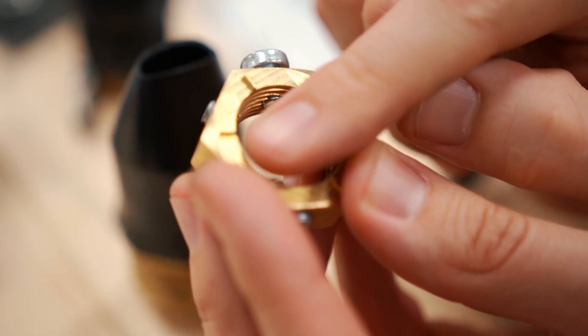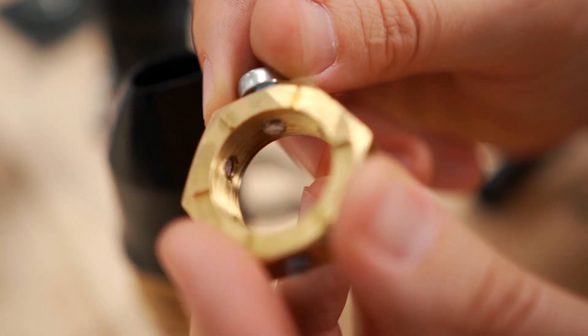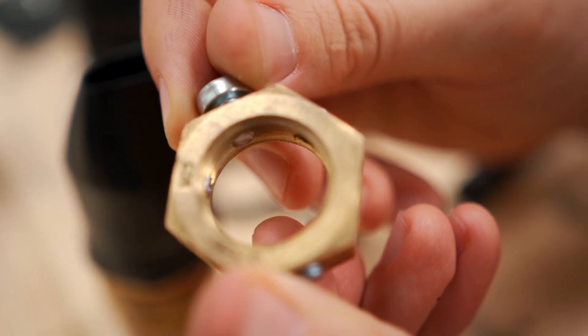The really handy thing is it's got these little teeth on it. This was primarily designed to go into a plastic enclosure — if you put this into a plastic enclosure and tighten it up, those teeth will bite into the plastic and grip it really firmly. That means you don't have to have the two lock nuts with the banjo in between. You can just tighten this up and connect your earth lead into the threaded holes in the side.